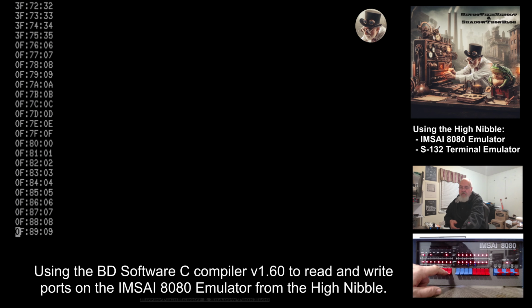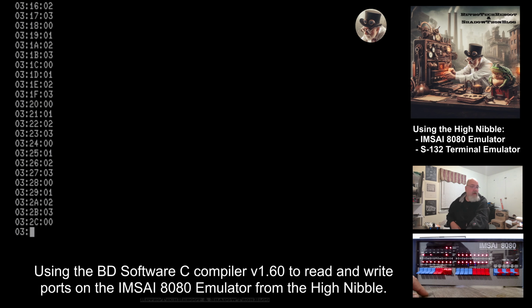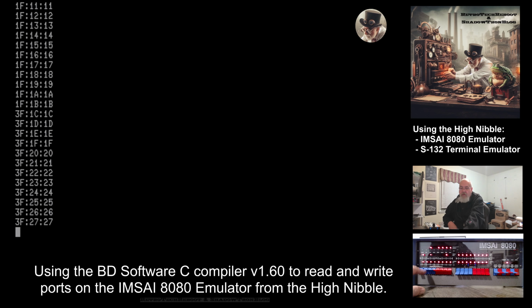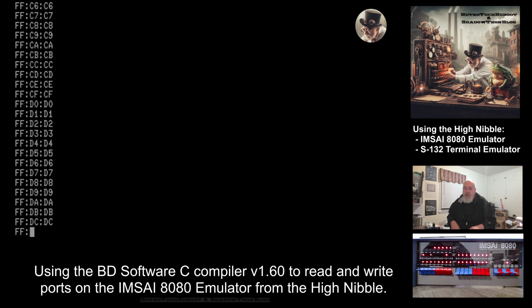Same thing, we can mask off LEDs. That one's blinking so fast now that you can't see it being on or off. You can kind of see this one flickering. Hopefully it's showing up there on the webcam. It might be. That one's blinking a little slower. So remember, we're essentially taking the raw value out divided by 2, divided by 4. This would be a divide by 8, divide by 16 of that loop counter. 32, 64, and 128. And in that mode, you can see that nice binary up count from really bit 2 up through bit 7. Maybe from bit 1 to 7, depending on how good a job the camera's doing here.